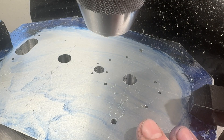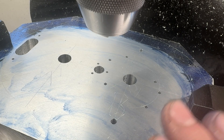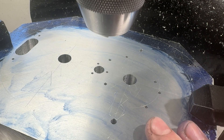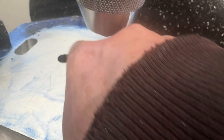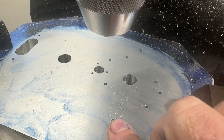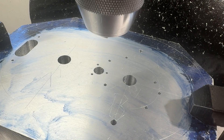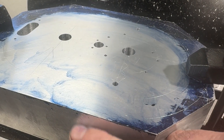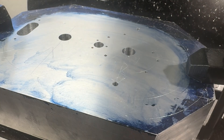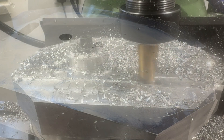I'm hoping I can get some electronic ignition for this, but if not I've got the holes drilled already. These are the standoff holes that go against the actual stand for the whole engine. So what I'm going to do now is put this as it is on the rotary table — I'm going to be putting a boss in here, which I'll film for you, and then this has got to go down a certain measurement so this boss is proud. It's a complicated little part.